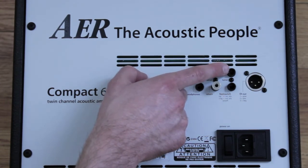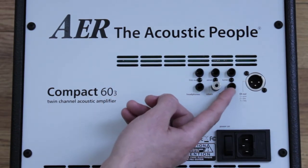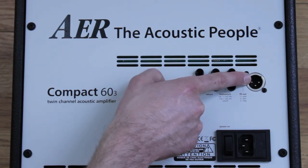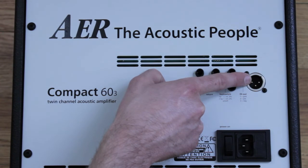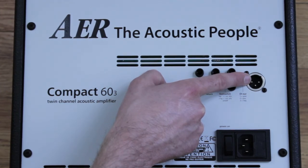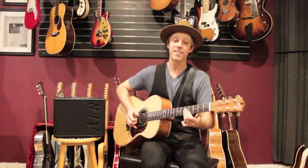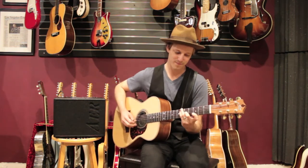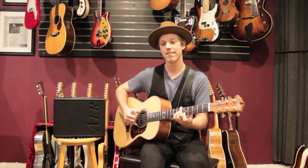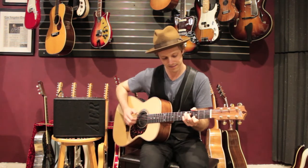The tuner output supplies a pre-master signal to connect to an external tuner. You can also use a foot switch with this amp to turn your effects on and off. To the right is a three-prong XLR DI out, which is what I use to send my signal to the house when playing a theater or concert. For solo gigs at a restaurant, they'll sometimes take this output and run it through their PA system. I'll see you next time.